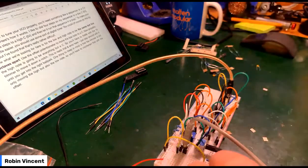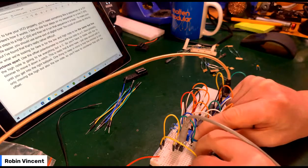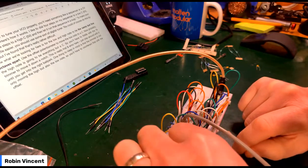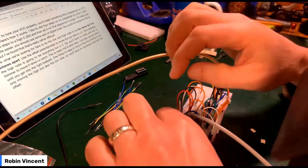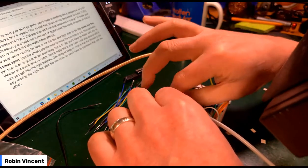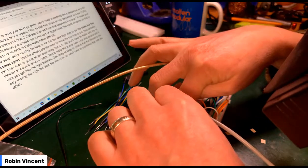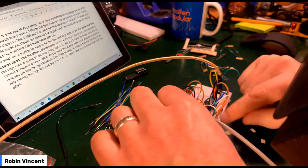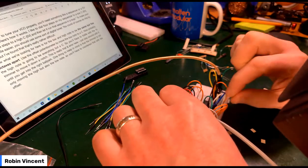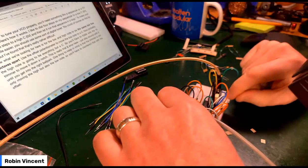So I'm just going to go through this breadboard and attempt to stop things from touching each other to make sure that we've got the cleanest possible signal. There's 3 going to there. And I touch everything and everything has a bit of a cow about it. But, you know, it does sound fairly sawtoothy. These really long patch wires are not helping, obviously. But I could literally cut a whole load of them down.